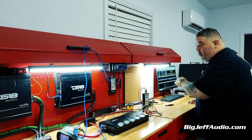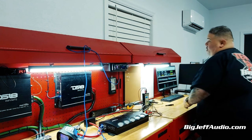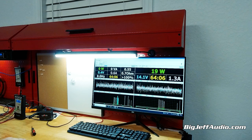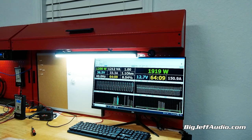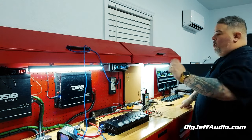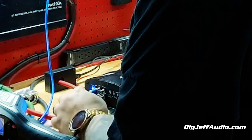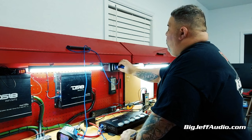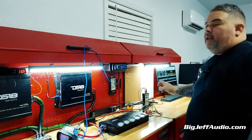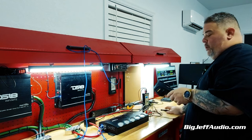I'm going to play the track, and then we're going to flip the camera over here to watch the screen. We're at 1 ohm. There we go — 40 hertz. So I'm watching over here on the meter. We're going to steady 1182. We had a peak at 1208. Now, we're going to get it right to clip, which I already adjusted the amp through right under. The clipping light on the SMD will just click or soften. We went up a little bit.